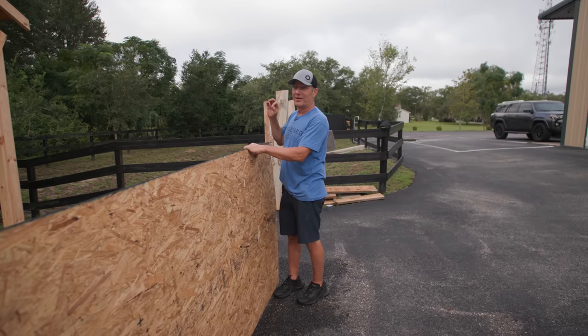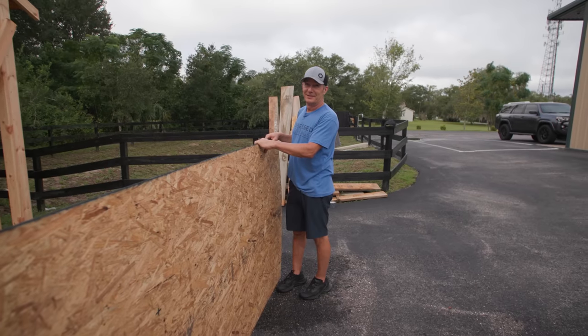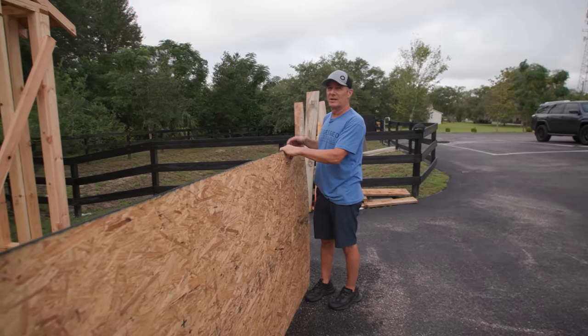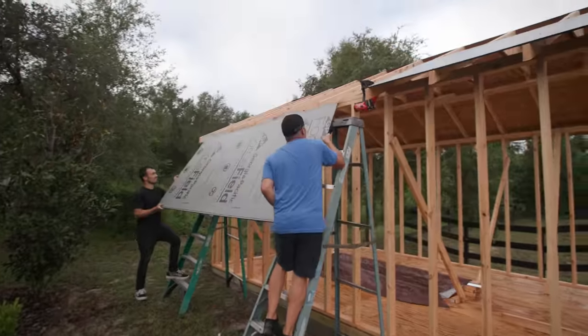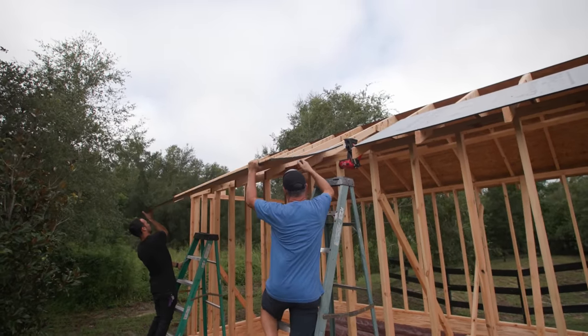The walls were spot on 20 feet. Now they're almost a half an inch over, 20 foot, 7/16. Once it dries, it'll shrink back up, but that just shows you how much wood grows when it gets wet. All right, Trev, grab that side. And go your way at first. Push up.